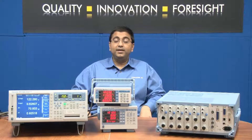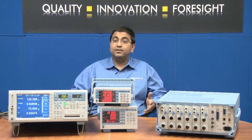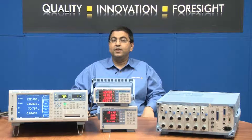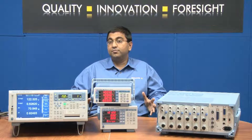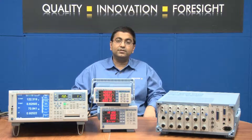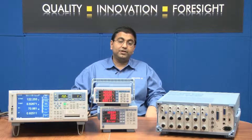You may ask why. The shunts built inside the power analyzer are highly accurate and calibrated for both AC and DC signals. The accuracy of the current measurements made by the instrument is guaranteed based on the shunt's accuracy, which in turn also defines the accuracy of the power being measured by the device.